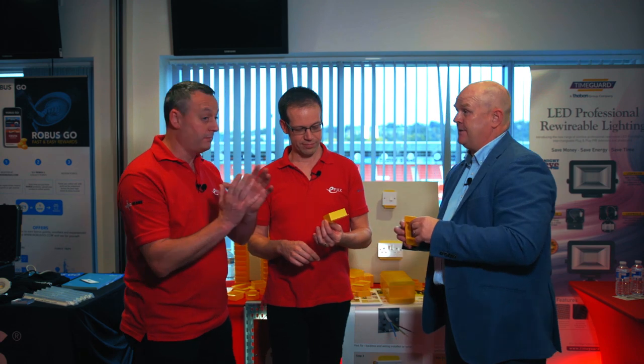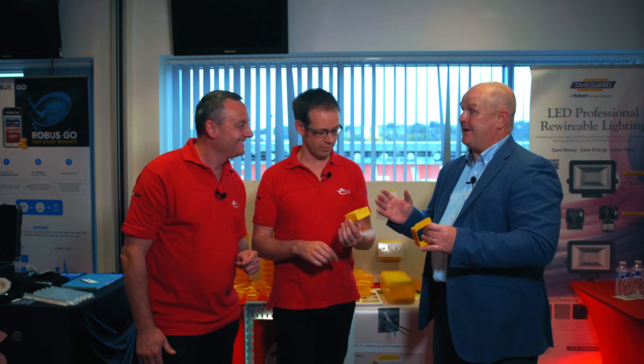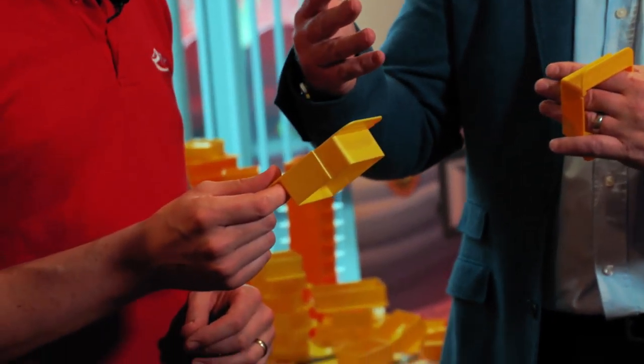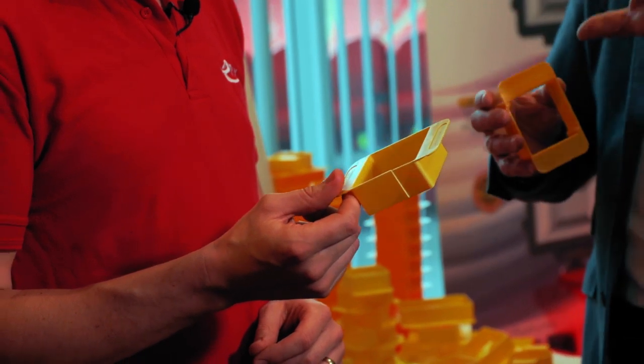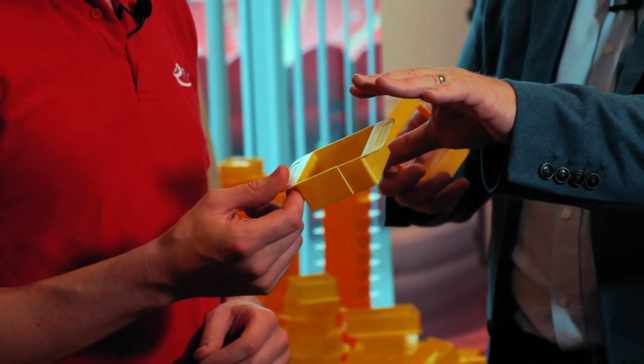They're plastic? Yes, they're plastic. It's a big thing nowadays, isn't it — are they recyclable? Yes, it's high impact styrene, which is grade six. High impact styrene is the most recyclable plastic on the market. You can recycle it as many times as you want and it won't lose its integrity — unlike some plastics which you can only recycle once and can never be re-injection moulded. So the disposable one can be recycled as many times as you want, and the reusable one can be reused as many times as you want.